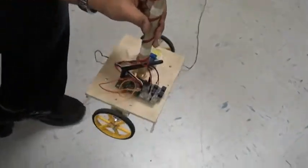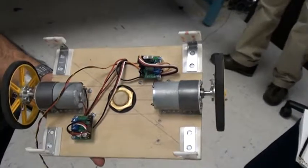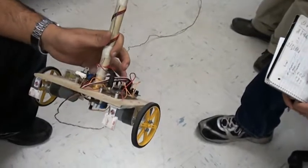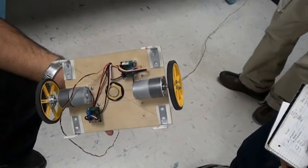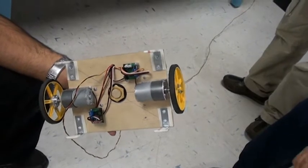There are some motors on the bottom, some motor controllers here — Pololu DC motors. The motor controllers are driven by this board, which generates the PWM as received from VXWorks, and the PWM drives the motors accordingly. These are off-the-shelf motor controllers and off-the-shelf RF units, integrated together in this design.